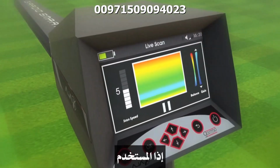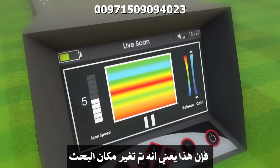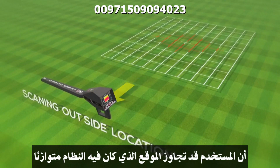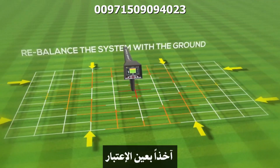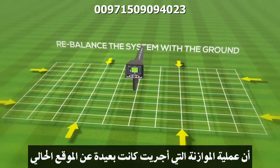Note: if the user notices a disturbance in the colors or instability, then the ground type might have changed and the user passed the location where the system was balanced. So, the user should rebalance the system with the ground, taking notice that the balancing process is done away from the probable target's location.